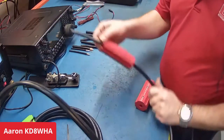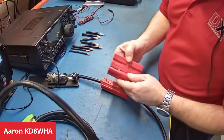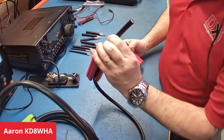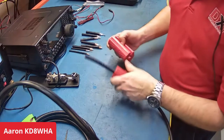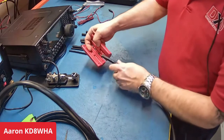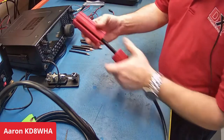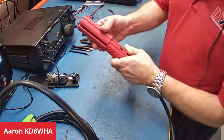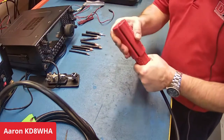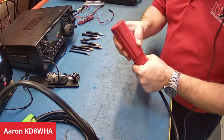What I usually do is put it a little ways back and open up — is this RG-213, Aaron? Yes, it is — our DX Engineering 213 cable. You've got a channel inside of the strip tool. You lay your cable inside of it where it presets where each of the blades go. Then you can slide your gripper right up to the back of the tool and hold it in place so while you're cutting the cable it doesn't slip out.